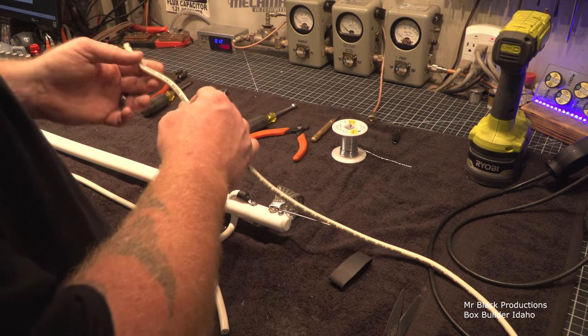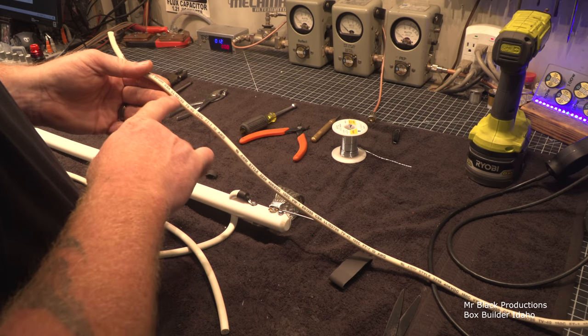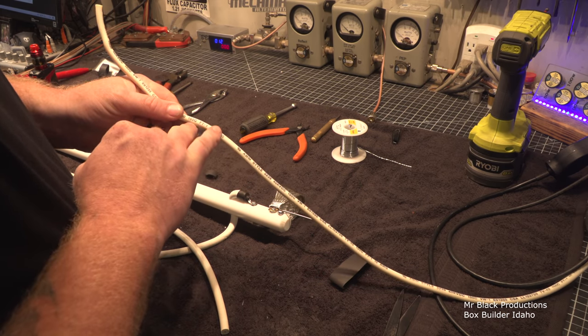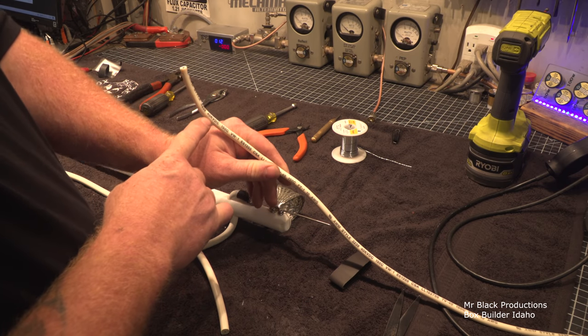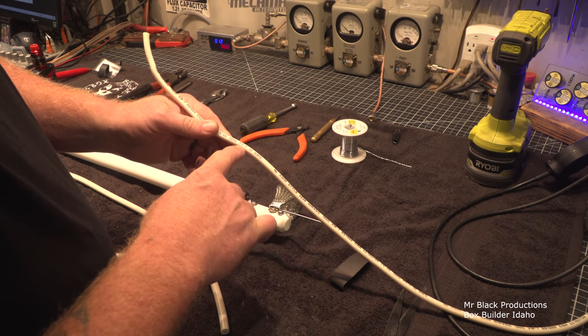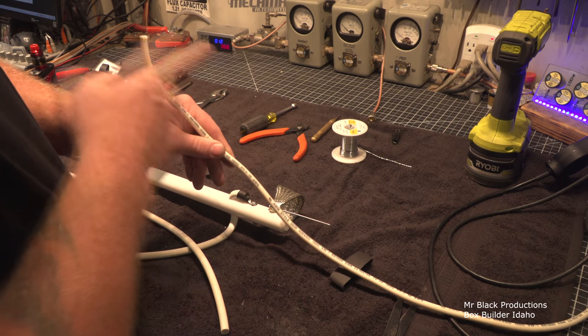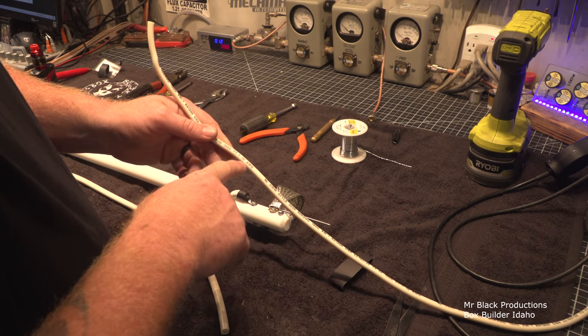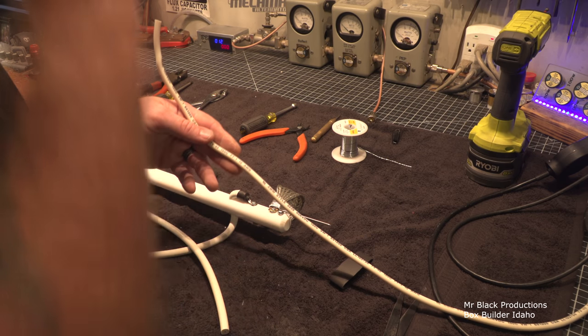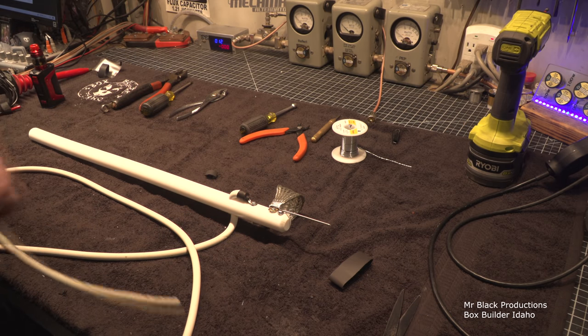And then we go on to talk about all the compliance issues. This can survive and continue to maintain this rating up to 150 degrees Celsius, and then it gives you the rubber it's made out of, the silicone it's made out of, and then the gauge style and an American wire gauge standard. So it's usually printed on everything like this that has anything to do with high voltage. Teflon, you can't print anything on it. Nothing sticks to it. Nothing.